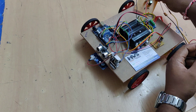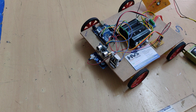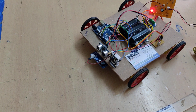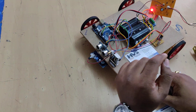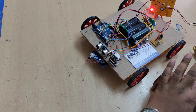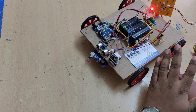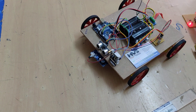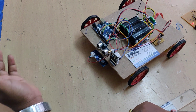After connection, keep the charger aside and do not place it on any part of the robot. Then turn on the power supply — you can see the red indicator showing the battery is charging. The battery will be fully charged in a duration of 6 to 8 hours maximum. Keep the battery under charge for that duration, then disconnect it.